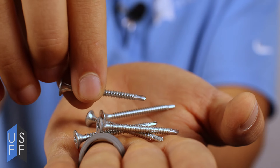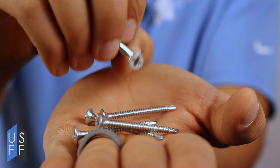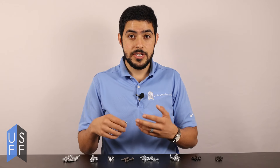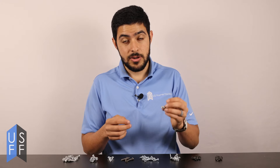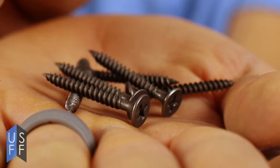If you're dealing with drywall, you want to make sure you have a screw with a bugle head so that you don't tear the drywall as you screw it in. Hex head screws are great for driving but they can't be used on surfaces where you need a very smooth and flat surface, because they will poke out through the plywood or drywall placed on top. Hex heads are easier to drive than Phillips head screws, which have a tendency to break your bits.